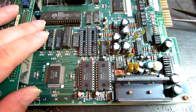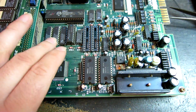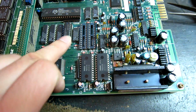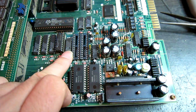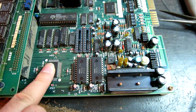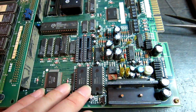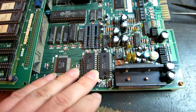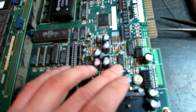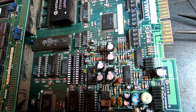The sound section basically consists of the main Z80 CPU. There's the buffers here between the address and data lines and the rest of the circuits. There's a custom PAL decoder here. There's a dual 2 to 4 line decoder, I think that is. There's a PCM chip here, I think this is Rico. There's two Yamaha YM3438s, and then I think there's 1, 2, 3 op amps and the main amplifier. I think this is stereo, I'm not sure.